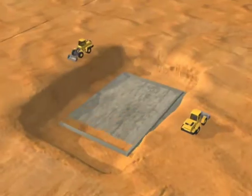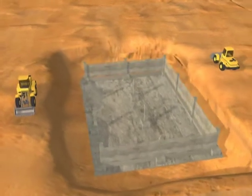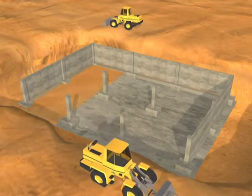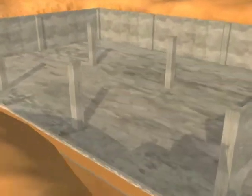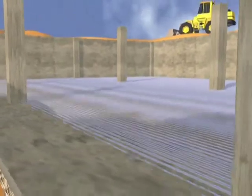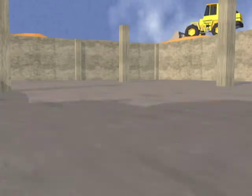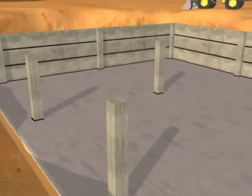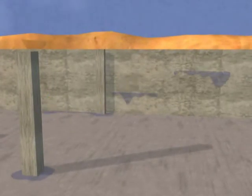Basements have chronic leakage problems. After constructing the footings, columns and retaining walls, the flooring is started. Soling and PCC are laid in sequence. Finally, the concrete slab is cast. Several cold joints are formed in this process. When the water level rises, water is likely to leak through these construction joints.